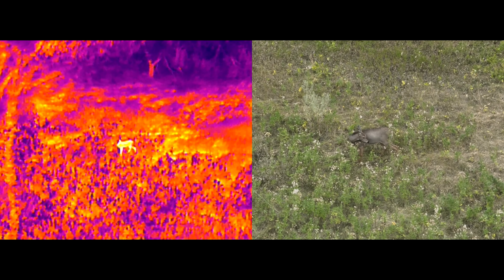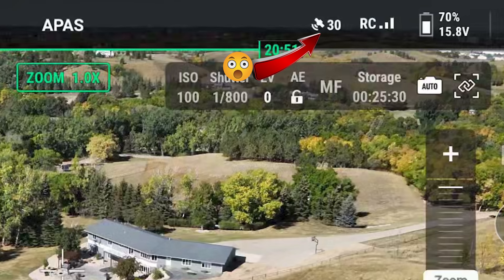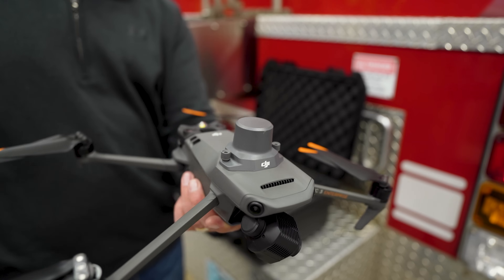For the individual commercial drone pilot, this multi-camera system means they can offer a wider variety of services and grow their business. Next is the global navigation system — the M2EA has just GPS and GLONASS, while the Mavic 3 Enterprise uses GPS, Galileo, and BeiDou. Plus, with the RTK module it adds GLONASS as a fourth system — more stable, more accurate, and that's key for so many use cases. Next, moving from OcuSync 2.0 to O3 Enterprise transmission — the best way I can describe the difference is like going from dial-up internet to one-gig fiber optic. No more lost signals, which is crucial for pretty much any commercial application.